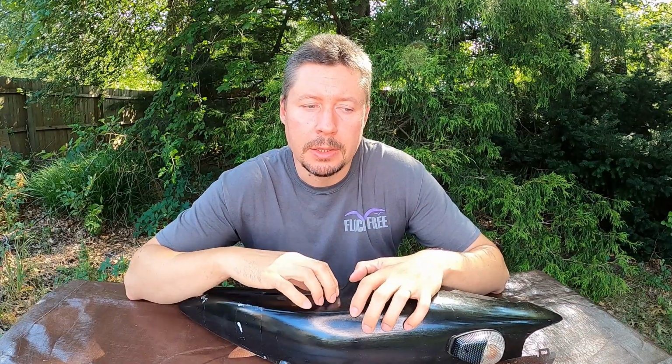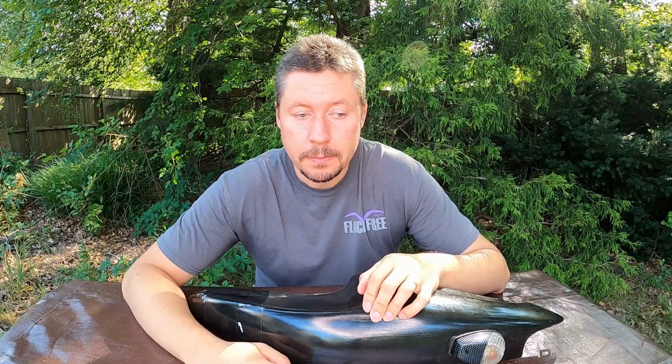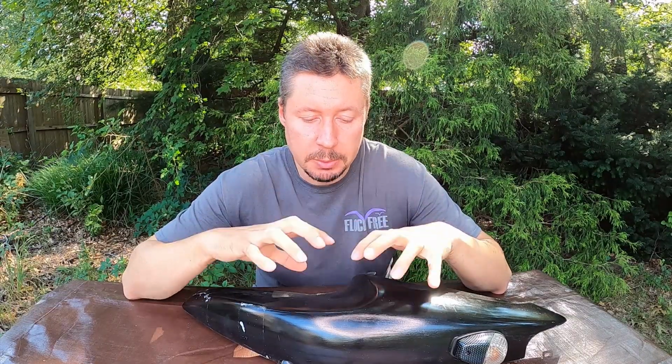And these are kind of conflicting ideas, because you want it as smooth as possible. But if you sand it to the smoothest state, the particles of the paint will not be able to bond with this surface in the right way, and with time the paint can just peel away. So the solution is some kind of compromise. We prepare a surface, we make it smooth, but not very smooth. It should have some micro scratches, and these micro scratches will keep the particles of the paint and bond with them. So basically you should decide what level you want to reach.